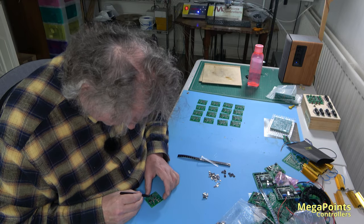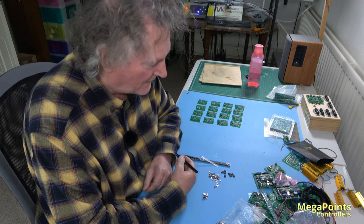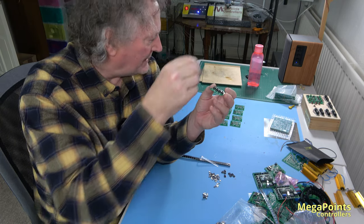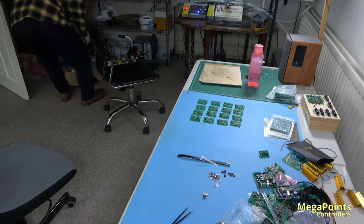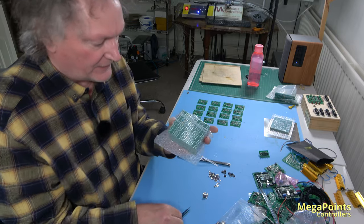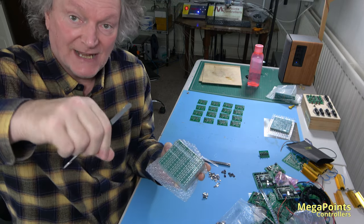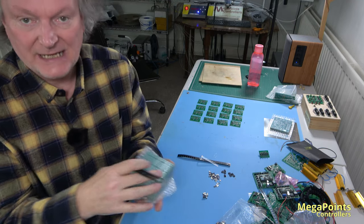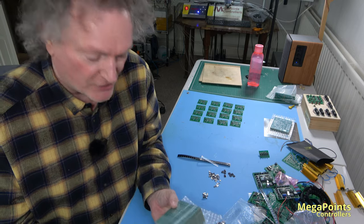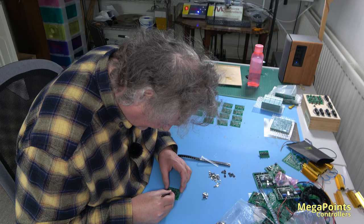We've also had a massive week — ten days — making buttons. There's a PCB for buttons: 25 in a blank, 40 buttons on top. We solder paste it, then have to place the buttons by hand because if you use the pick-and-place machine the buttons rotate, so that doesn't work. Then it gets soldered, comes off the solder, and you turn it upside down and put all the pins in — two pins per button — it's a really slow process.